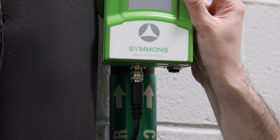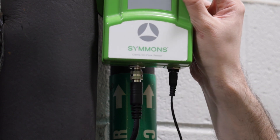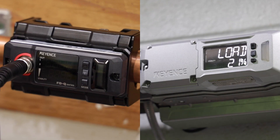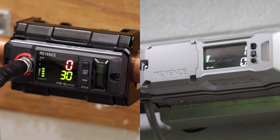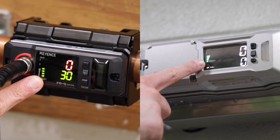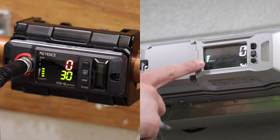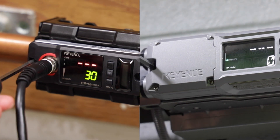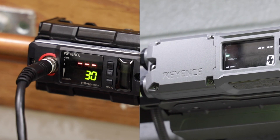Now that our sensors are mounted, let's power up the modules and connect them to the gateway. First, insert the power supply connector into the green sensor module, and then plug it into the 110V AC outlet. You'll notice that the controller on the flow sensor will light up and run through some diagnostics. The most important display on the controller to be aware of is the stability indicator — it's a series of LED bars that let you know how stable the connection is between the sensor and the pipe. If you have less than three bars, you'll need to check the surface of the pipe where the sensor connects, or check the tightness of the pipe clamp. Once you have a strong signal, you're good to go. Your sensor module is ready to connect to the gateway. The system startup video will take you through the final steps to activate Evolution in your property. Thanks for watching.